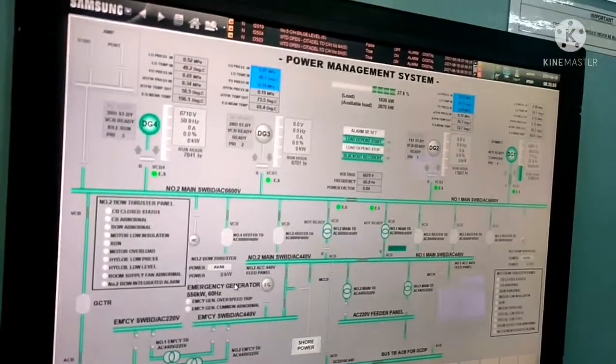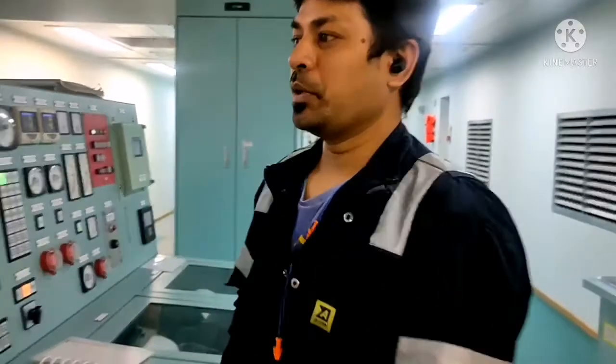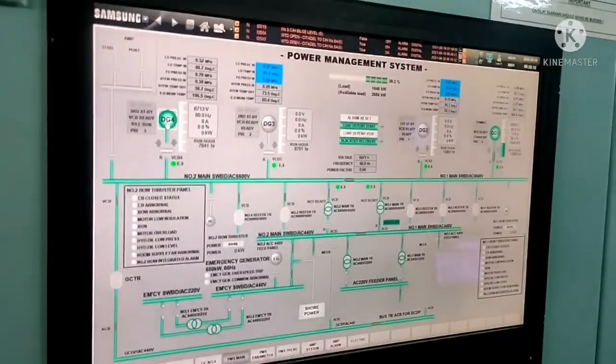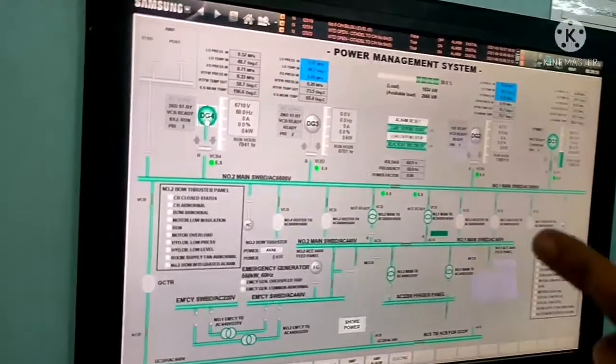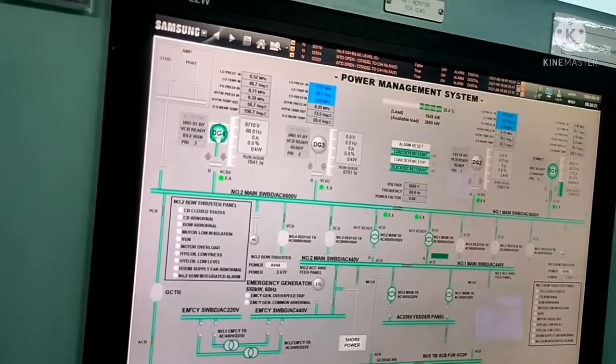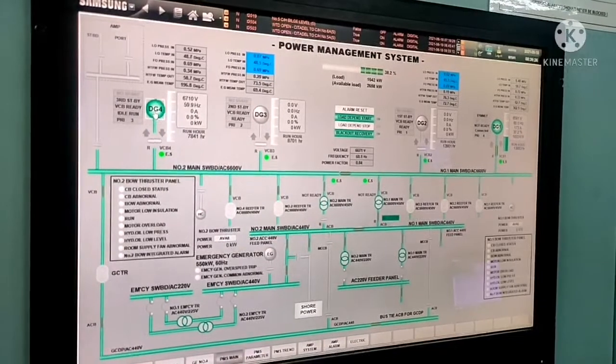So actually, when one generator is running and you want to take load on the generator which we started now, we have to first do the load sharing between both the generators. Then only you have to do the shifting of your load. So now I am going to do the load sharing. So all I need to do is, in this video I will show only the ICMS, how we do the load sharing. In my next video I will show you how to do manual taking of load in the switchboard.